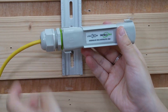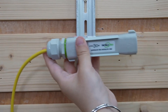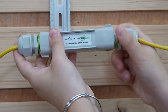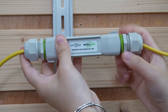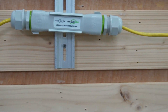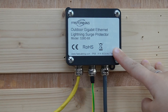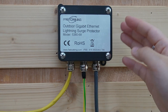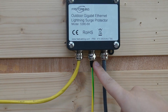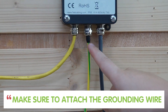When you do the installation, make sure you use a wrench to tighten the neck and the gland so nothing can get in. I'm going to use another short patch cord to connect our PoE Extender — plug it into the input port — and then mount it back on the DIN rail. This short patch cord goes directly to our Surge Protector. For better protection, especially in areas prone to storms, adding a dedicated Surge Protector is a must, because an additional layer never hurts. Make sure to attach the grounding cable, as this will keep the entire setup protected.